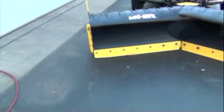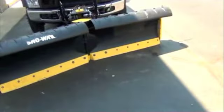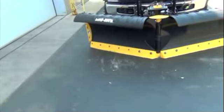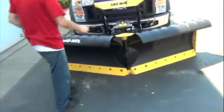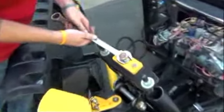It's now touching the ground all the way across. Do one more final check and bring them all the way back into the V position to verify that everything is touching the ground. Everything is evenly touching the ground at this point — your wings are now adjusted properly. You will have the best cleanup you can get with this plow now that the wear strips are properly adjusted. Come in and tighten up your set screw or set nut here to make sure that does not get out of alignment.